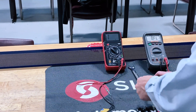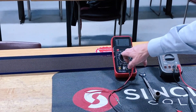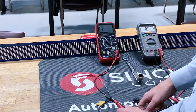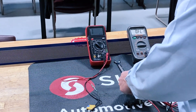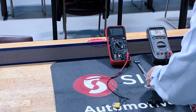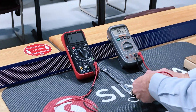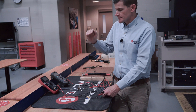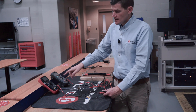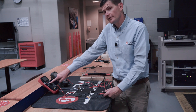When students use a manual ranging meter, they need to know to start on the lowest range — the 200 ohm scale — then move up to 2,000, 20,000, 200,000, 2 million, and 20 million ohms. The reading will show infinite until it falls within the selected scale's range. For example, on the 200 ohm scale it reads up to only 200 ohms; on 2,000, only up to 2,000 ohms; on 20,000, only up to 20,000 ohms. You start with the lower scale when you expect a smaller measurement, like a fuel injector that might only be 10 to 12 ohms.